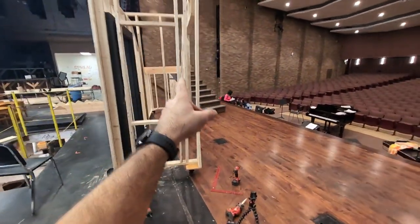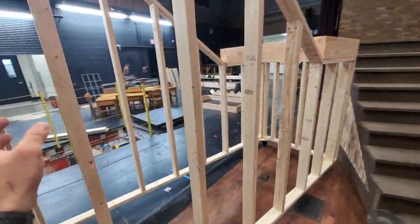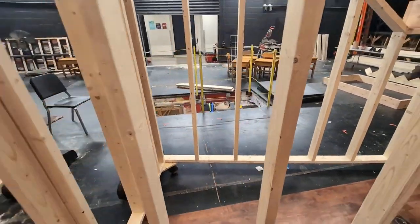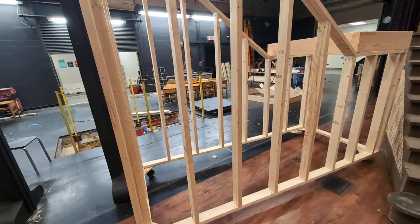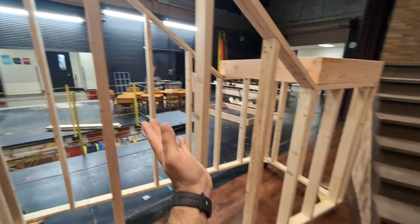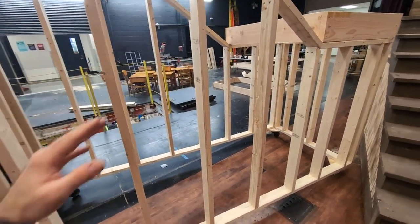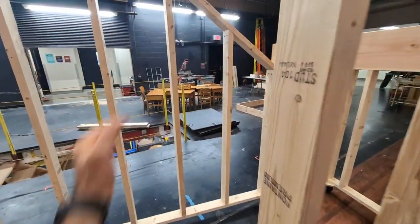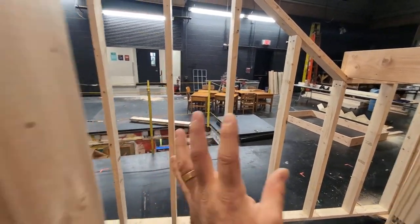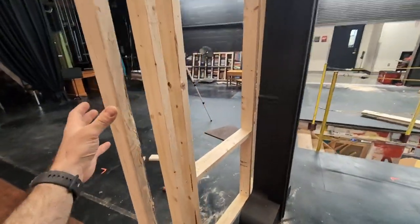The rest of the interior box of this other set piece can get some 2x4 sticks running around. Now, I want to be able to get in there and do the magic chalkboard. So when we built this for Adams, I had some three-dimensional sticks trussing this out to square, which we've got to be careful of now because we want interior space. Normally I would go across the back side of these at an angle once it's perfectly true and do the same on the other side, but in the opposite angle and on the ends. But doing it on this side, like I said, we're going to have mostly a big opening here that we have to magic chalk through it. And so it'll probably be the one wall that doesn't end up being trussed that way, just with the skin on it. And in the case of this wall, it's not thick enough.